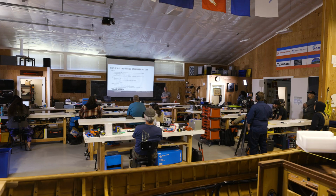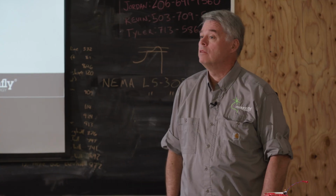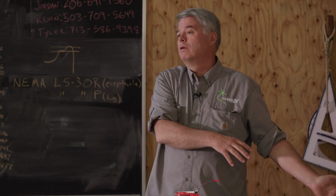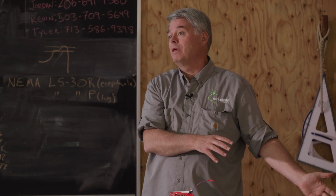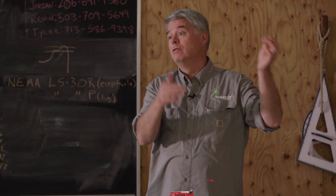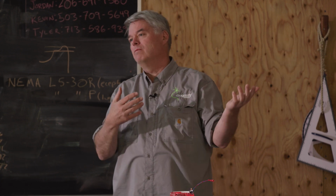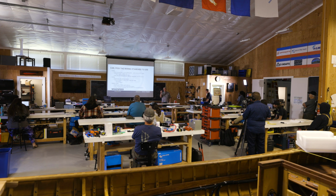Yes, ma'am? Is NMEA 183 compatible with the NMEA 2000 connectors? Is our what? NMEA 183. No, no, they are totally different. Yeah, good question, but no. NMEA 183 was before the CAN protocols became available. It accomplished a similar function. GPS talk to your chart plotter. On my personal vessel, that's what I use. But really NMEA 2000, the CAN-based stuff, this type of connector, for the past 20 years is what they've had.